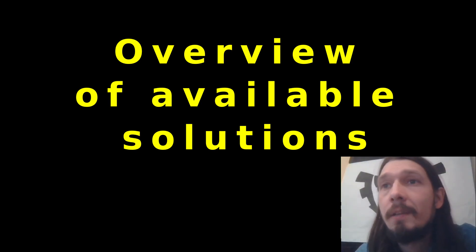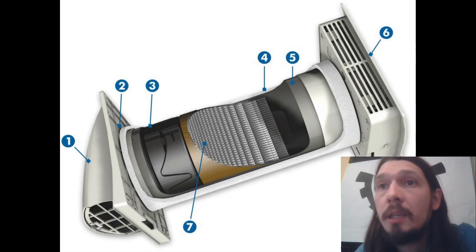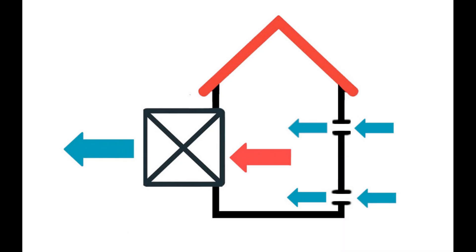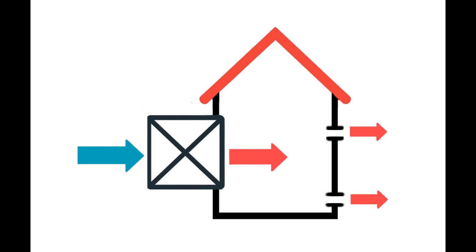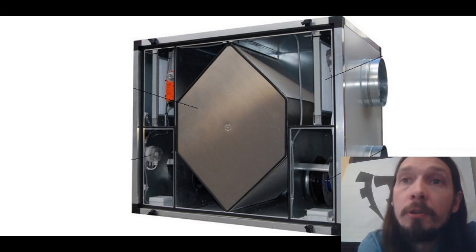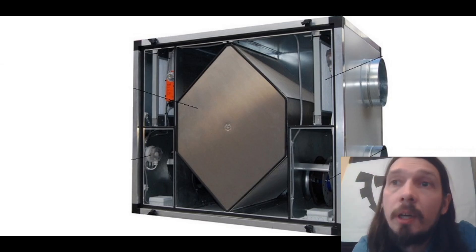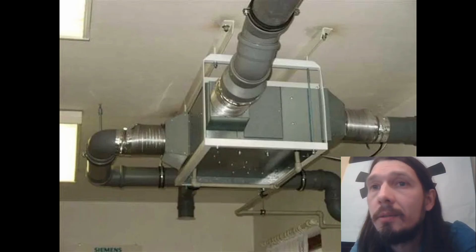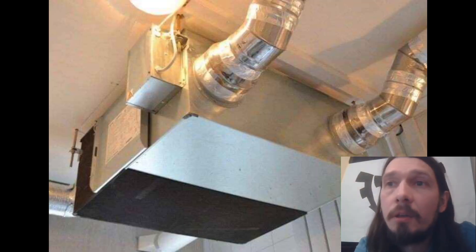Before doing it myself I looked at ready-made solutions. On the market I saw two types of design. The simplest is a heat exchanger made from tubes plus a fan that alternately blows warm air out, heating the tubes, then switches and blows cold air in, warming it from the warm tubes. The problem is that a house isn't airtight — if a noticeable amount of air is being pushed out, fresh air will be sucked in through various gaps instead of waiting for the recuperator to switch to intake. There are also full industrial heat recovery recuperators where intake and exhaust go through separate channels, but they're expensive and bulky — you can't fit those into a window.